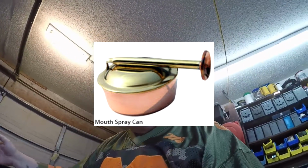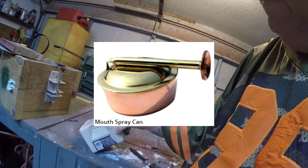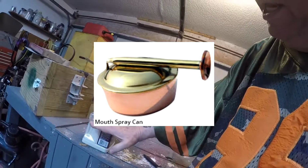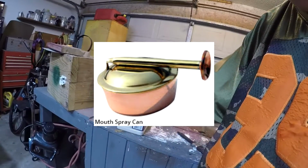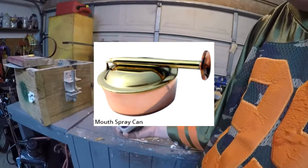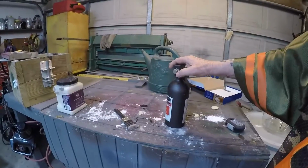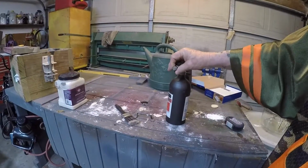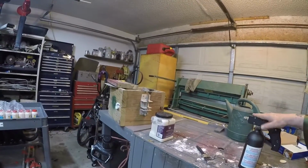Okay, this mold wash isn't too thick. Everything is still suspended in there. It's not like all the heaviest materials have settled out and you have to mix it all over again. It's very good. I mean, it's an excellent mold wash, as you can see from that. But this just didn't handle the little tiny hole here, and the adjustment didn't handle that. So I would have to get something better, like maybe a paint sprayer instead of just a light lubricant sprayer.